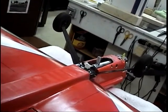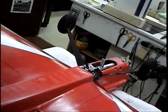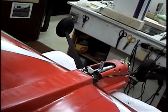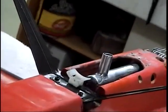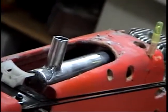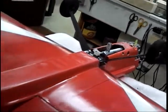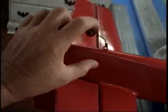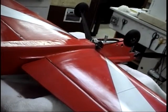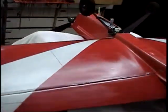And I know the 451 worked, and I know 375 is going to choke it, because it gets on the verge of choking it on a 77. So this test, the next day we get to fly, will be, I hope, an interesting test, and it'll also let us know if we need to put the mount back under there. It also sits in the plane nicer. It'll clean up. And here's the other possibility when you design a fuselage cosmetically: not having to make the whole back of the fuselage 2 inches wider for the pipe or higher, in a lot of ways, just makes a lot of different designs possible. A lot more semi-scale, a lot more possibilities.